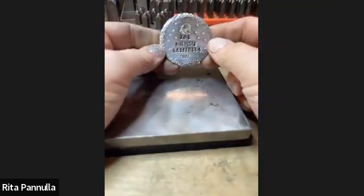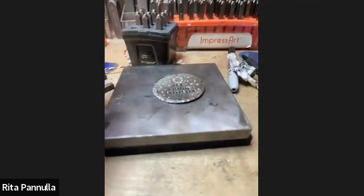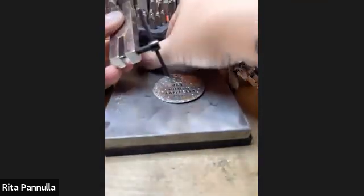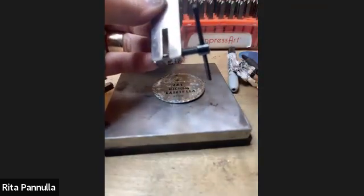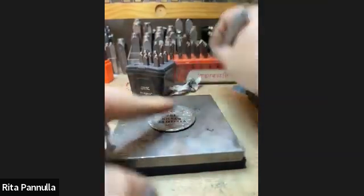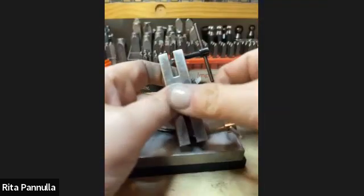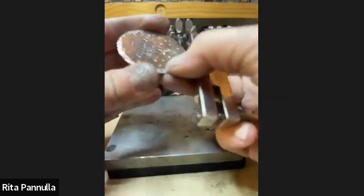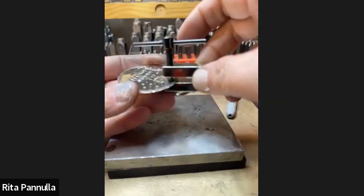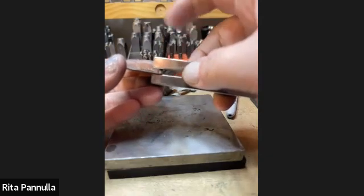Okay, with my block, now I'm gonna come in the center where I've marked my hole. Okay. And I'm going to use my screw down hole punch. Let me pull you guys up a little bit so you can see better. Better mark that. Okay. So now with your screw down hole punch, I'm going to use the bigger hole. Okay. I'm going to feed it right inside and make sure that that punch, do you see that black dot? That punch is right on my black dot.